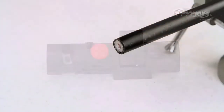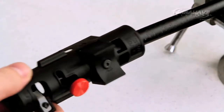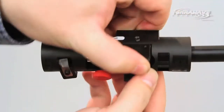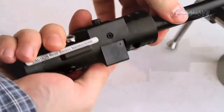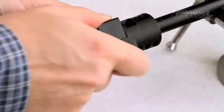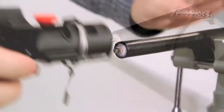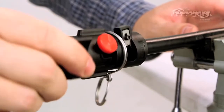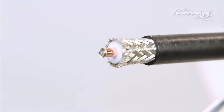Step 2: when the stripping tool is properly adjusted, insert the cable into the stripper so that the cable is flush with the end of the tool. Step 3: spin the stripping tool around the cable until the tool spins freely. Step 4: pull the stripper away from the cable while lightly squeezing the jaws of the stripper. Step 5: insert the other end of the wire stripper onto the cable and spin gently. This cut will remove the outer jacket and expose the braided cable shield.